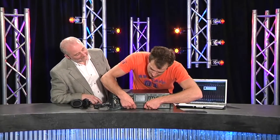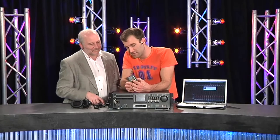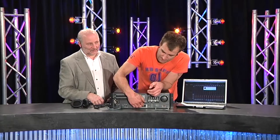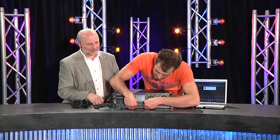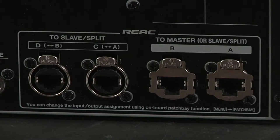The other way you can get data out is to take the little cover off the front with the little thumb screws, and you've got this little caddy-based drive. On the back of it there's actually a little mini USB port, so you can plug this drive directly into your computer and download directly to your workstation — just treat it like a drive. If you don't have REAC devices and want to get other audio in and out, there is a MADI-to-REAC bridge from Roland called the S-MADI bridge, which will cost you a couple of grand. It converts your MADI stream — or at least 40 channels of it — into a REAC cable that you can plug straight in.